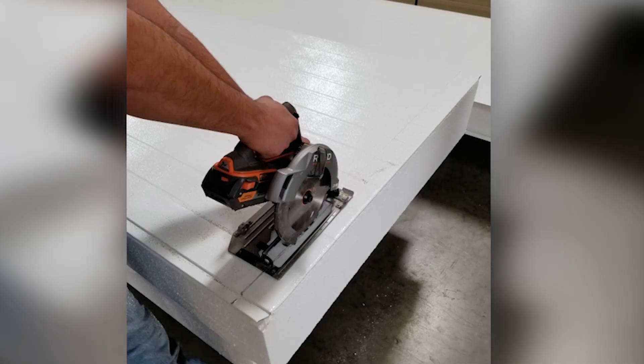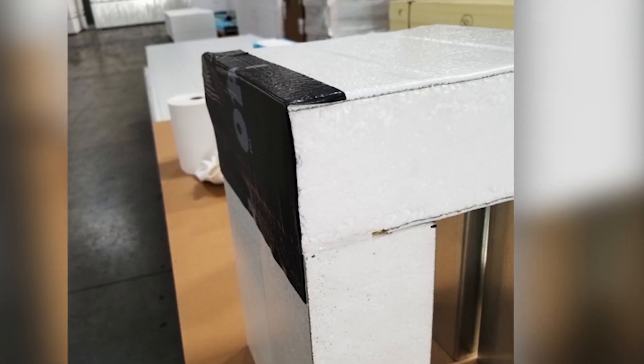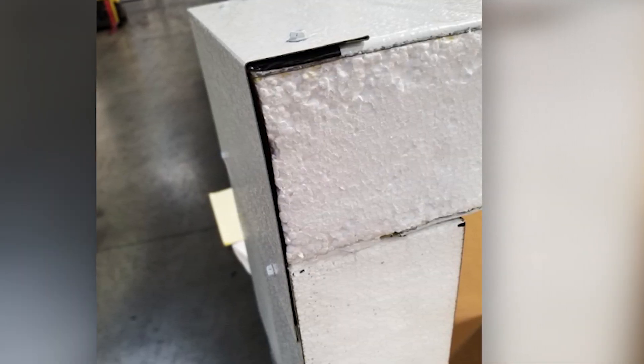At all wall-to-ceiling and wall-to-wall corner connections, a proper thermal break must be made to the panels. The removal of a minimum three-inch-wide strip of the ceiling panel metal is recommended as a proper thermal break. The exterior side of the wall-to-ceiling and wall-to-wall corner joints must also have a vapor barrier applied before the outside corner trim is applied.